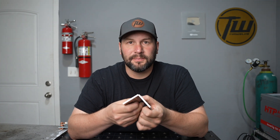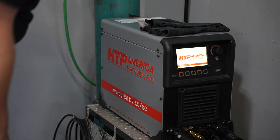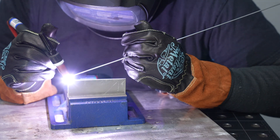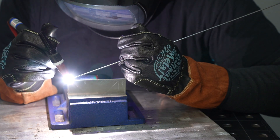The first thing is your parts need to fit together really well. You can't have any gaps or else this isn't going to work at all. If you do have a little bit of a gap based on how your parts fit together, you can add a little bit of filler in advance to bridge that gap and close it up, and that will let you proceed and tack weld it together. This is only necessary if you have a gap that's unavoidable and you want to hold it in place to tack weld without filler.